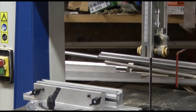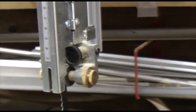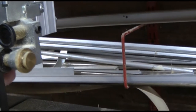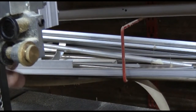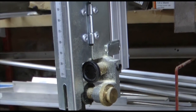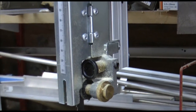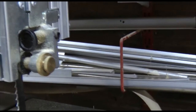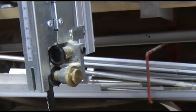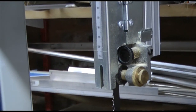It works well. The blade guides are interesting. You know, the jury's out as to how long they're going to last, but they don't turn, there's no bearings on them at all. They do turn of a sort, but they're more like having people put sacrificial wood sometimes on the bearings to allow you to reduce the blade movement. But with this saw, because of this type of guide, it does allow you to go down to 1/8 of an inch, which I found was one of my requirements.